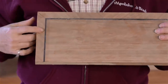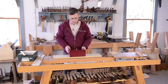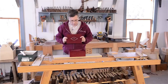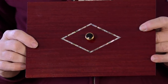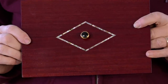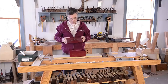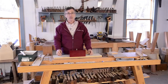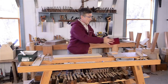Here's a sample piece I made for somebody demonstrating something very similar. Again, the black veneer could be inlay. This is definitely inlay — what we've got here is a mother of pearl sheet which has been inlayed into a piece of solid purple heart. This is actually quite difficult because these lines are not parallel to anything, so you can't use the edges as references, and if you don't lay it out exceptionally well, your eye will see the errors. There is a precision required both in laying out what you're going to do and then in doing it. Get your layout right, and then we'll work on technique.